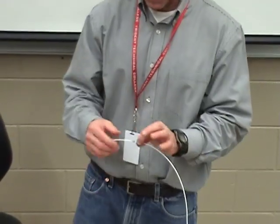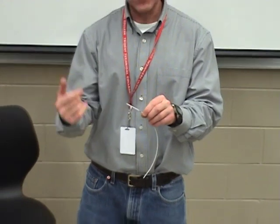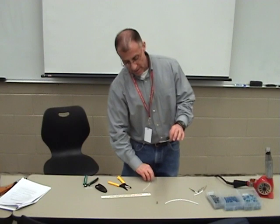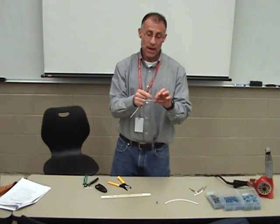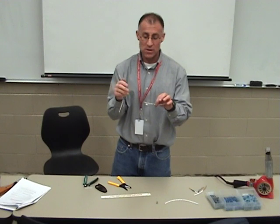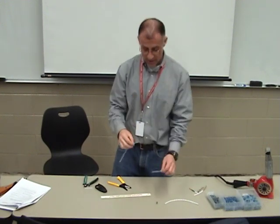I've got to prepare — I'm going to solder two wires together. The second wire will be the other side. I'm doing an emergency repair on this cable. I'm going to cut this off and do the same thing on this end — I'm going to pretend the wire got cut and we need to reconnect this shielded wire. I can splice the center conductor, but if I don't repair the shield, you're going to have an area where EMI — electromagnetic interference — can come in and penetrate the center conductor. I need to re-protect it with the shield itself.